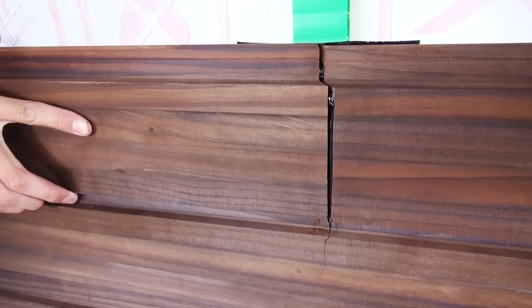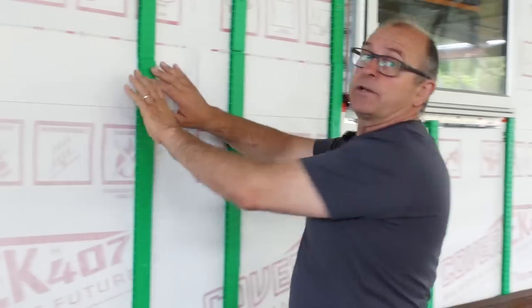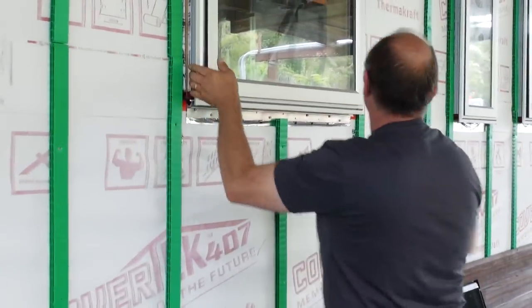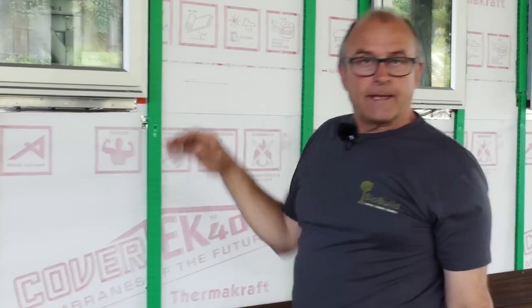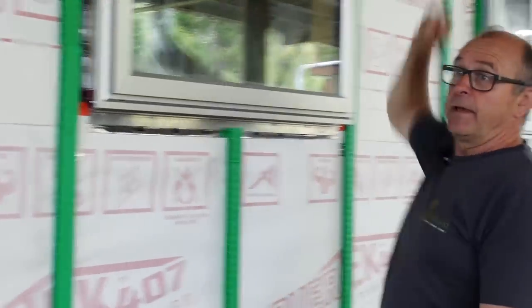Now a little bit about joins. Depending on the stock you can purchase and the sizes you actually need — longer ones here, shorter ones here, even smaller ones — what we do is go right around the building, make a cutting list, and work out good ways of minimising waste. That might mean one particular length gives us three pieces, or two of these and one of those. It can get complicated, so you need a list of everything you need and then work out how to divide your stock to make the most efficient use of it.